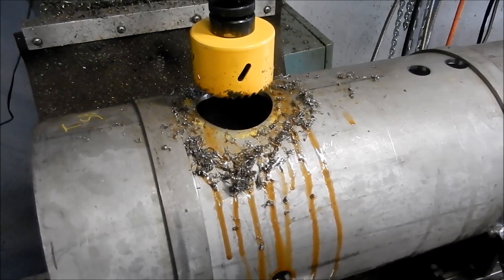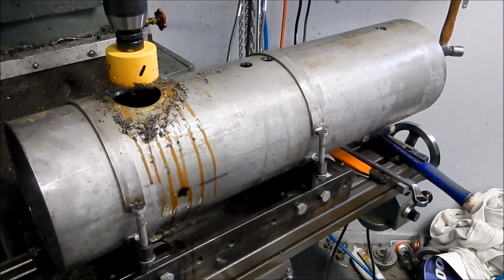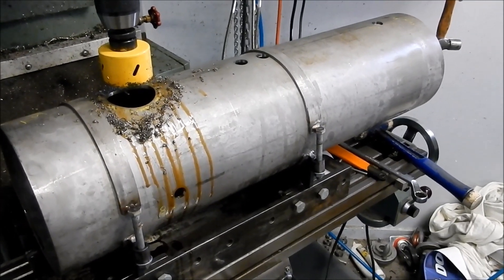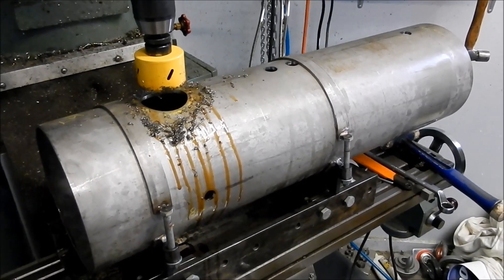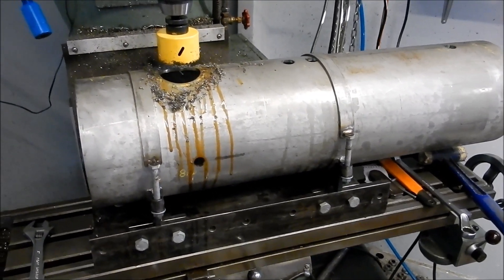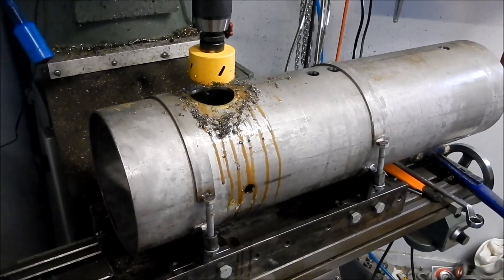You'll get everything ticked in along with all the bushes with the penetrations through the boiler. But a lot of work to do on this — I've got the smoke box tube plate to do, the fire box tube plate to do, bore out for all the tubes, lots of stays to be done, and obviously all the bushes, and a lot of other peripheral stuff we're doing as well. I'll keep moving on, set up for the bore, get that close to size and wait till I get the dome bush to size it too.